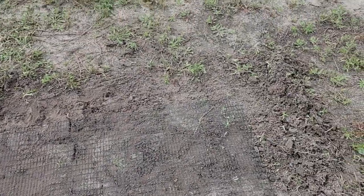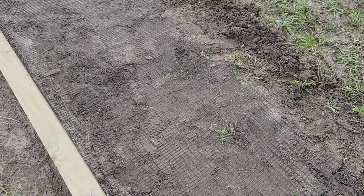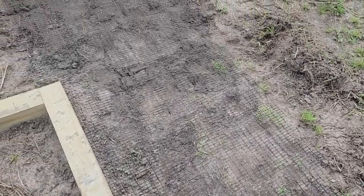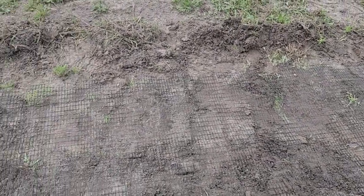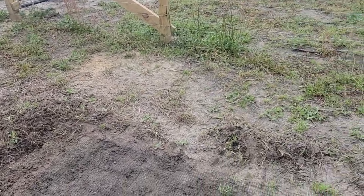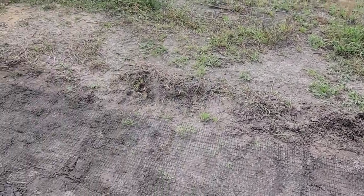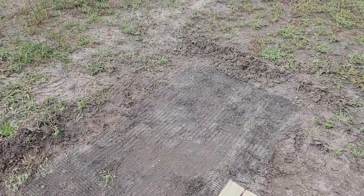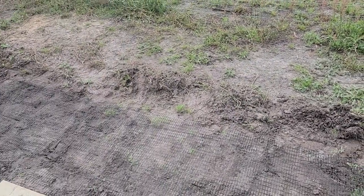Here are the staples — I just put a couple here to hold them down so they don't curl up. I have them every 8 inches on the perimeter and staggered every 16 inches in between, and the same thing over here. Now I'm going to come back and take the garden rake and put the soil back in, except for the ends — I'm not going to do that because we still have to put mesh on when we go the other direction.